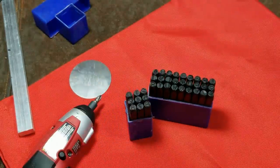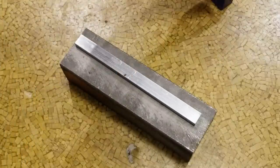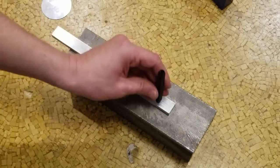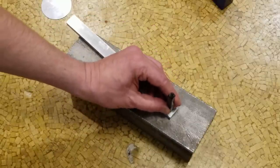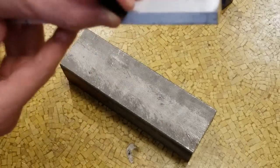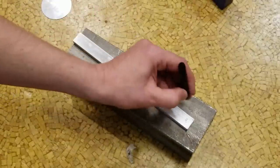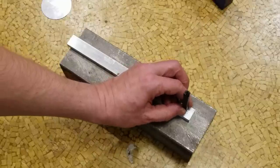Let's take a quick look at these in action — we'll do it on a couple pieces of material. I'll just do a couple quick stamps with the ampersand here and then maybe spell out the first name of my channel, and I'll show a tip about stamping thin projects. On something like aluminum, you don't have to hit too hard, but it's surprising how much force you need. Another aspect is trying to make sure that they're sitting flush and flat — there really is a lot of technique. This is 6061 T6 aluminum and you really do need a bit of force.